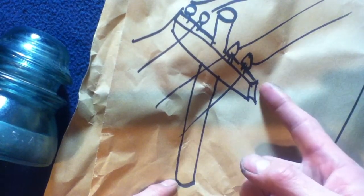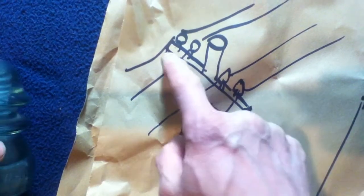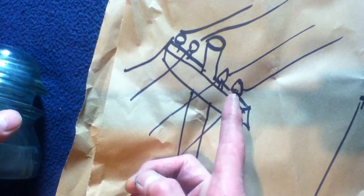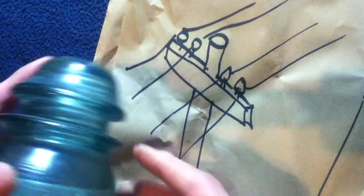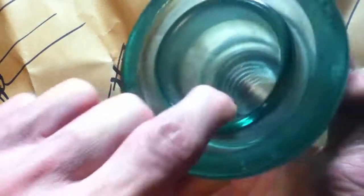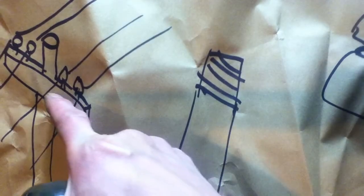I've made a couple of crude sketches. This is the traditional style of telephone or telegraph pole — these were used later for electrical wiring as well. The insulator would be mounted on the cross beams on what are called pins. These pins are typically made of wood, which is also less conductive than metal, and they would be threaded at the top and driven into the tops of the cross beams.